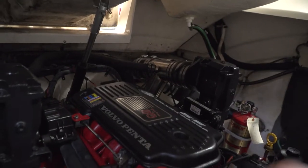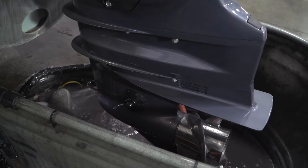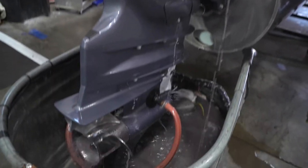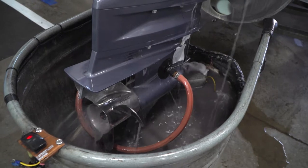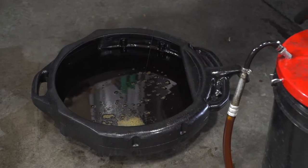Moving on, we look at the engine of the boat. Marine engines are cooled by lake water, and that water has to be drained from the block to protect it during freezing temperatures in the wintertime. We run all of our boats on antifreeze tanks — a mixture of antifreeze, rust inhibitors, and corrosion protectant. We also recommend oil filter service at the end of the year.